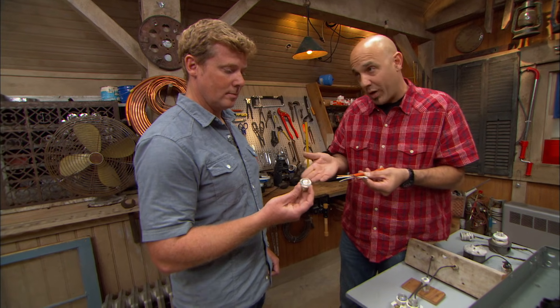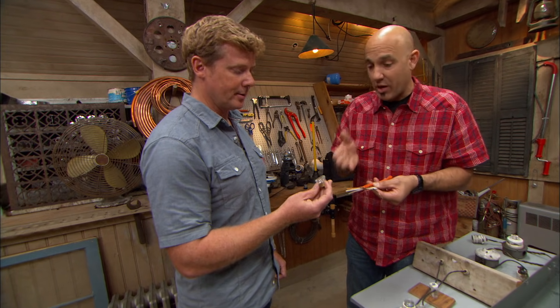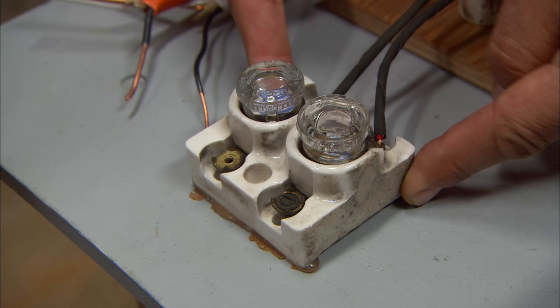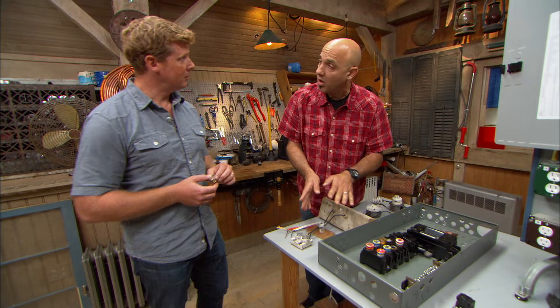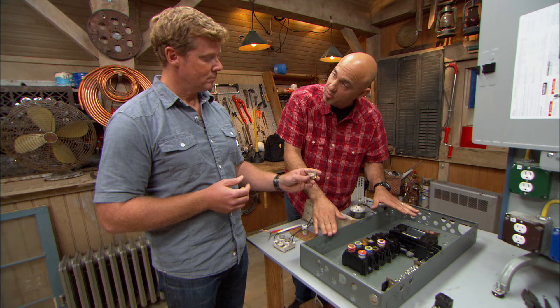You've heard of a 15 amp, a 20 amp, or a 30 amp — that's usually what I think about with fuses or circuit breakers. That's right. That was the first line of protection that we had, and we would put them in a porcelain holder like this. And put the fuses in, and they would protect the wires going down the line. Then they came along with a more packaged version, where the fuses and everything was protected with this metal panel.